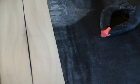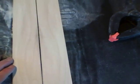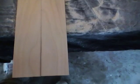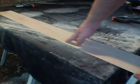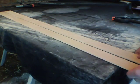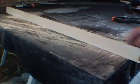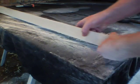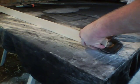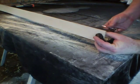Now you'll also notice that the way that we cut the two sides, they will be bookmatched. Since we cut them out of that same stock of wood, we can fold them over, and our grain will be pretty much a mirror image of each other. Now it's very important, if the grain's going to show, that we keep the book match in the right direction so that each side on the finished guitar will be a match to the other one.